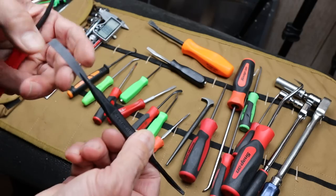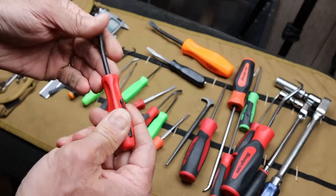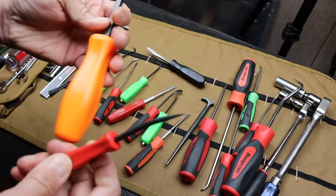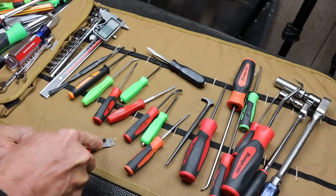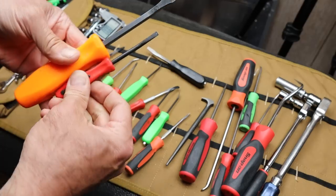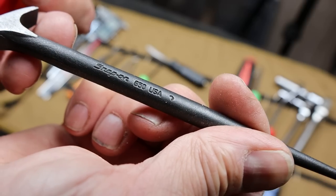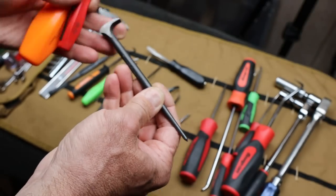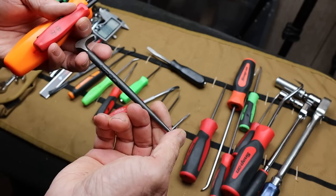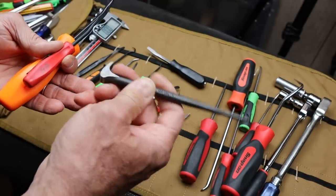So it's a step up from the nylon ones. Snap-on makes all kinds of these non-marring pry bars — they're really low-leverage bars. This can go up to about the leverage you can apply with a handle that small. I often use this one here, though I guess it's all gunged up — last time I used it, it was covered in glue or something. But anyway, this is really handy, and it felt small. This is way smaller. Here is a Snap-on 650 — kind of a lady's foot or a rolling pry bar, but a tiny one. I have these up to about 18 inches long, but this little one comes in very handy. It's just very limited because of the angle, but what it does, it does very well.